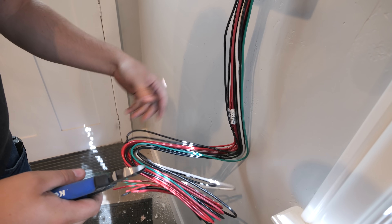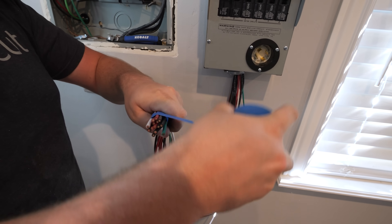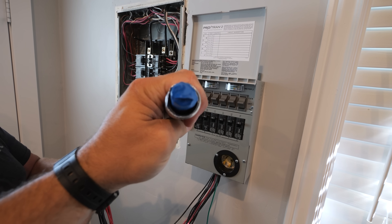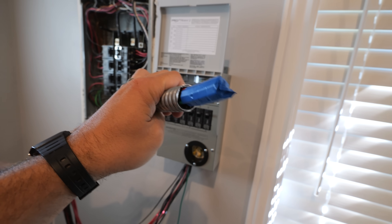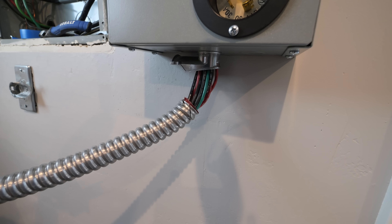The reason we completely cut the grid for these backup circuits is twofold: one, we don't want our electrical energy flowing out to power our neighbors' houses, and two, if the grid ever truly does go down, we don't want power flowing out, which would make a more dangerous situation for anyone working on the utilities.